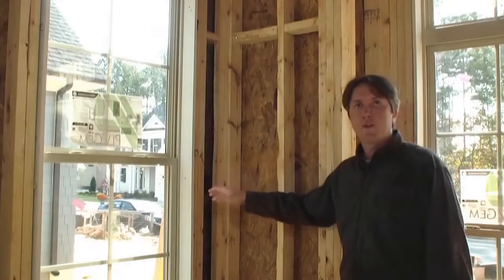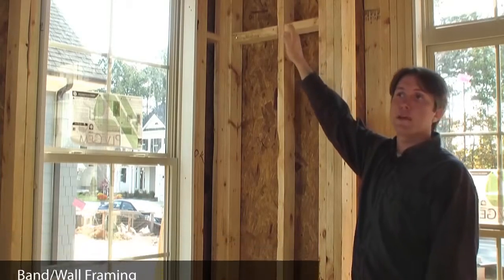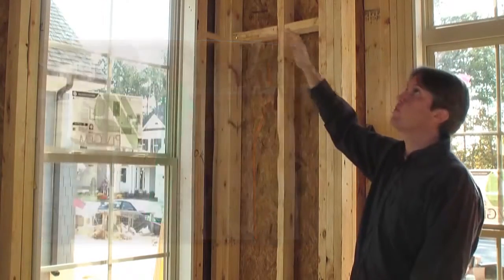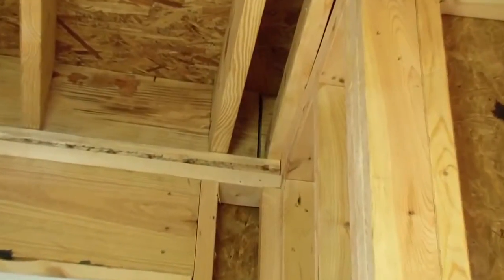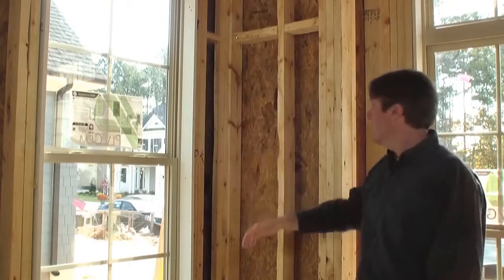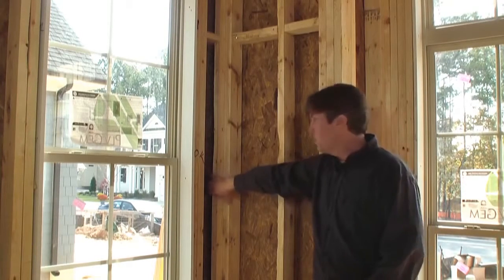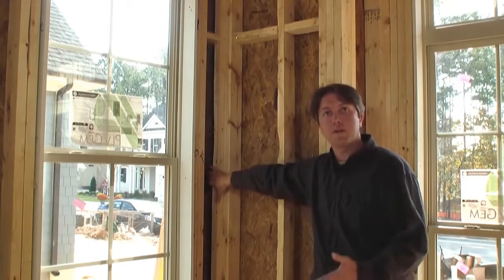Just to the right of the bay window, we have another spot with a few details. We have a band — part of the floor system that separates the first floor from the second floor — and we want to make sure there are no penetrations moving through the band. We have a small seam in the band that we'll want to air seal before insulation is placed. We also have a two-stud corner here, which is a great framing practice. Instead of building this corner solid with studs, we have two studs so that insulation can fully fill this cavity and we don't end up with an empty space without insulation.